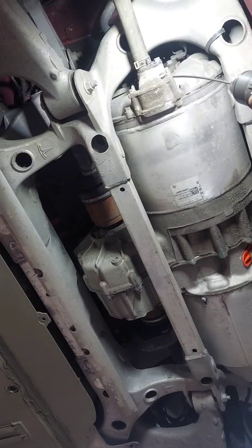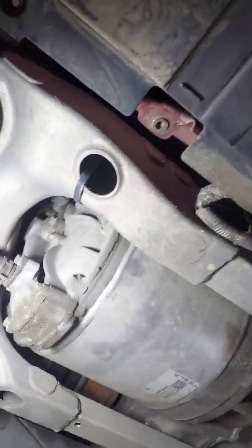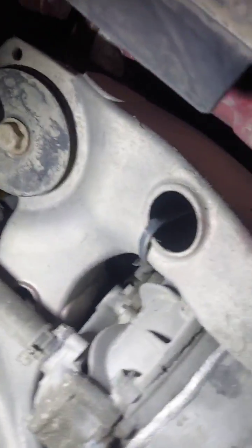As you can see, I've got an eighth-inch, 12-inch long drill bit, and you can see that I have got deflection drilling into the housing. You've got to be careful because you only want to go through the first layer of aluminum. I'm using the deflection — as you can tell, I went through the first layer. And that's it. You really can't see it. You're drilling a blind hole.